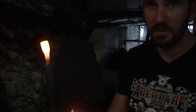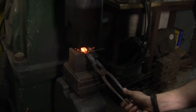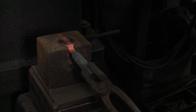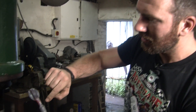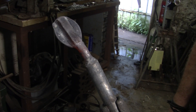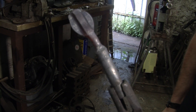Back to the forge, got a new heat, and now we're going to put the plate in. What we've got now is a square rib on the end with two sheets coming out. These will be drawn out on the anvil to make them a bit wider to accept the rivet for connection to the pan.